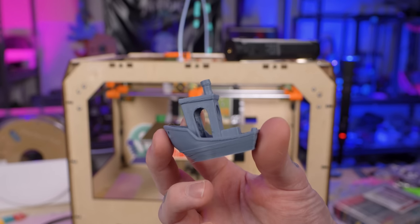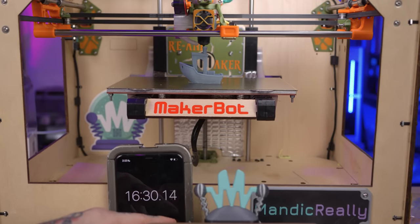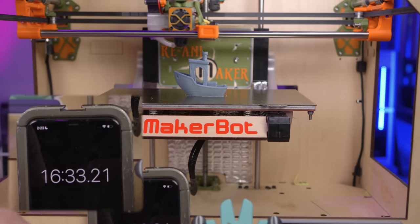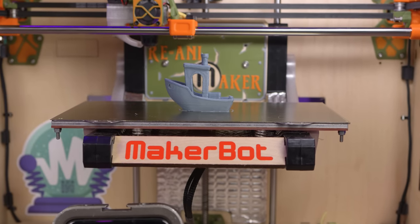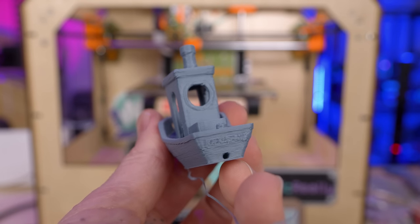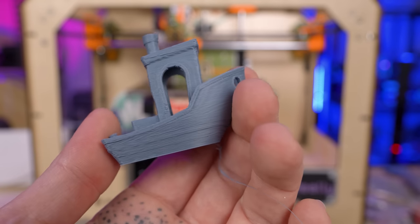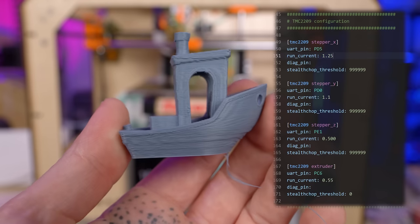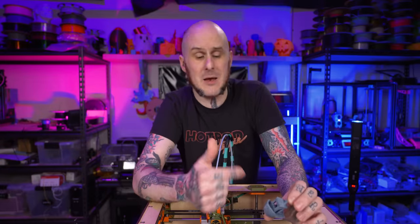So I dove into my config, made a few changes, and printed a 16-minute 33-second Benchy. It's by no means pretty, but it conforms to the rules of the speed boat challenge: 0.25mm layer height, 10% infill, 0.45mm extrusion width, printed in PLA. As for why I didn't get a layer shift on this one while actually going faster — I bumped up my motor current to 1.25 amps. I wouldn't want to run that on a daily basis, but that's what I ran for this quick test. And I turned off stealthchop and went back to spreadCycle — I think that's probably the bigger thing that kept my motors from skipping steps.